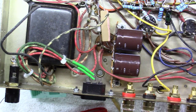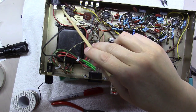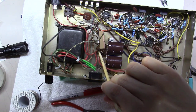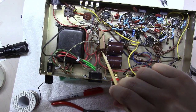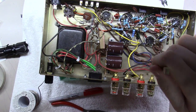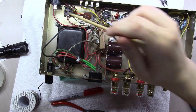It's kind of hard to tell by looking at this thing, but that's what was originally done. So you've got this capacitor right here, that one side of it goes to ground just like this, but the positive side of this one actually feeds over here and goes to the outer part of the can on this capacitor. And then the positive part of this can, which will end up being this little piece down here, is what connects to this resistor, this diode, and ultimately back to the center taps on the transformer. So I'm mimicking that same scenario between these two caps.